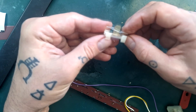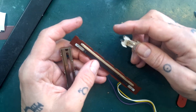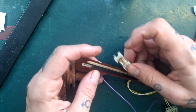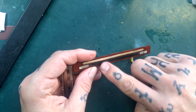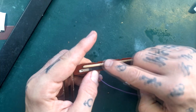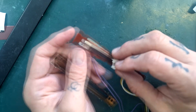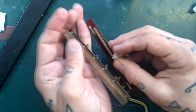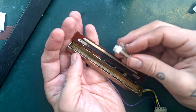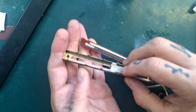You need to remember to put the plastic washer back above the tension spring on the mixer shoe. On this fader it's very obvious which way round the brush should be — there's a double brush that goes on the resistive surface, whereas there's a larger single brush that contacts the round bus bar. Therefore that must go that way round, so if the substrate and casing go together that way, we would put it in that way first.